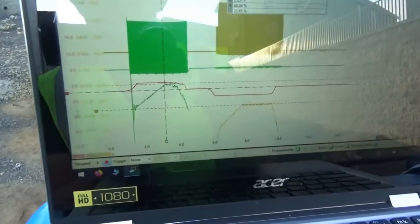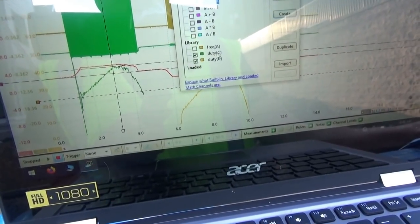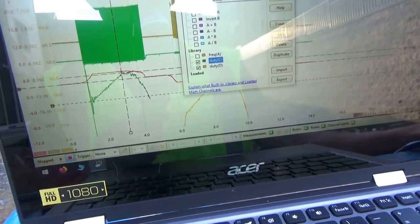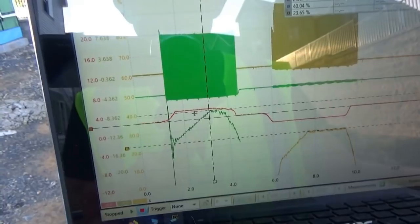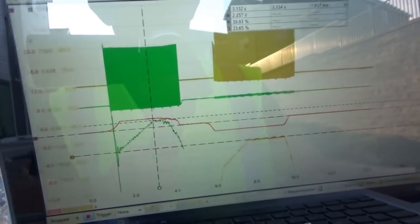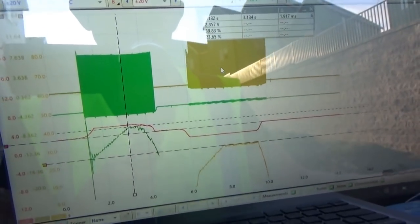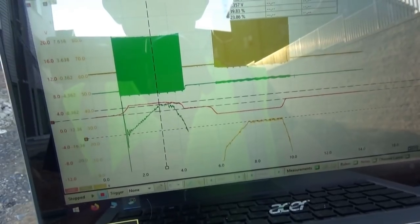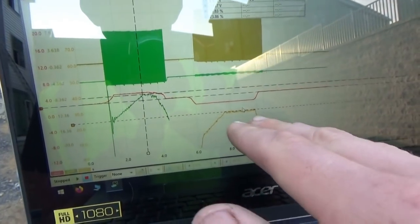So I want to be scientific here, so I created two math channels — you can do that by going to Tools and Math Channels. If you go to Advanced, I select duty and the channel name. The dark green is the duty cycle for our forward movement. The top value for the duty cycle ramps up and then boom — it reaches 40 percent. On our yellow channel in reverse, we ramp up and only reach 23 percent. That's about half the duty cycle of the green channel. I think this thing is out of calibration because they should be equal.